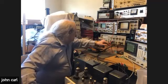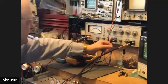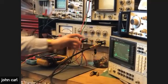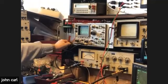So what I'm going to do is go to my input level again, which is here. It's at the end of the scale, and I'm going to change it by 3 times. It's a little over 3 times, 10 dB. And then I have to change this scale by 3 times. You can see that it comes out almost exactly the same. But that's 10 volts out, not 3. You can see the level here went up, and I have to scale that down. I can't even do it. I'm at the end of my scale, I'll just say.